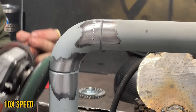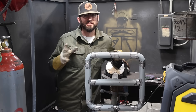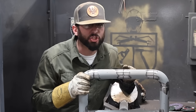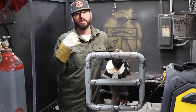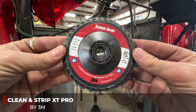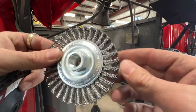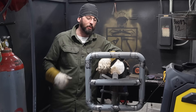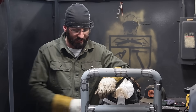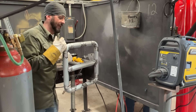Galvanized steel is not a tricky metal to weld — it's just steel with a bunch of schmutz all over it. To weld galvanize you've got to clean the coating off. I use this 3M cleaning strip — if you watch the channel, you know I use these a lot. It's one of the best alternatives to a wire wheel. I did use a wire wheel to get into some deeper spots, but the cleaning strip takes off all the galvanized coating with no problem and doesn't throw any crazy wires around in tight spots. It's just steel underneath.